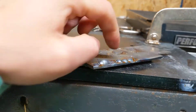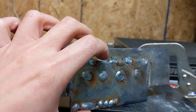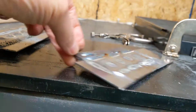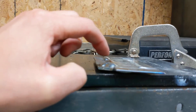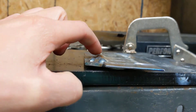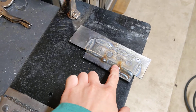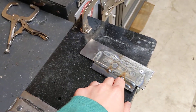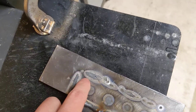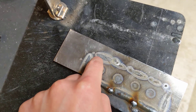Since it's so thick, I can't really see the heat that I'm putting in. So what I'm going to do is once I'm done with this, I'm going to take a cutoff wheel and cut it in half and hopefully I can see how well it penetrated through here. This is a better example where you can see it's balling up — that just means I don't have the right heat, so I needed to turn up the voltage and maybe even turn up wire speed. I watched a couple of videos and what I ended up doing is favoring the thick side with the wire, going along one inch at a time, and that kind of alleviated most of the heat going to the thin stuff. And as you can see right here, I'm getting plenty of heat in there and it starts off well, so I'm very happy with that.